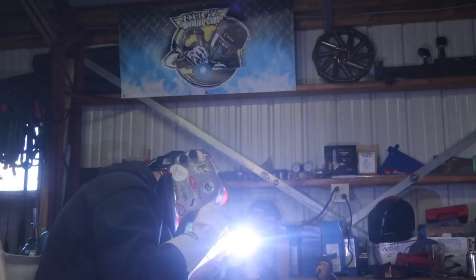Before I started welding on the part, I welded on similar thickness material, partly because I wanted to know what amperage settings I need. About 55 amps, you can tell by this, is about right, at least for me. Everybody has their own thoughts about what amps, speeds, and rod sizes work for them, but I like the 55 amp range. It allowed me to do a backward forward motion with the TIG torch and dip in the rod. I was also able to put a little weave pattern into some of the other joints.